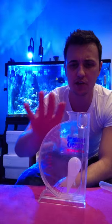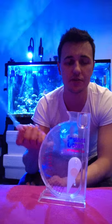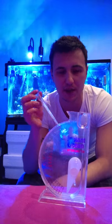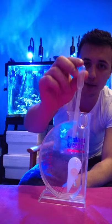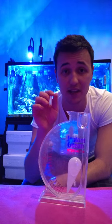Now let's talk about the hydrometer. You just dip it into your tank, fill it, set it on a flat level surface, and check the buoyancy. One thing to note: the needle can acquire air bubbles — it happens. Try to fill slowly. If you have bubbles on the needle, take something soft like a pipette or the eraser end of a pencil and very carefully poke the needle. The bubbles will come off and you'll get an entirely different reading. If you have bubbles on that needle, it's not going to be accurate whatsoever.